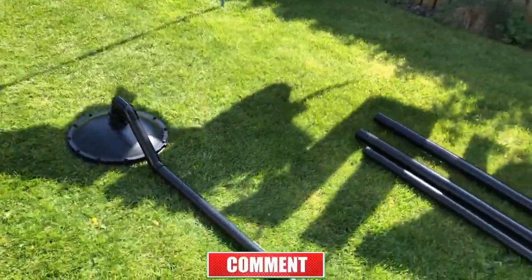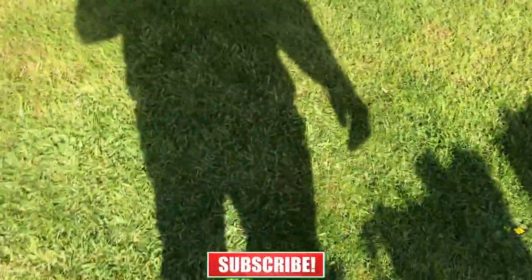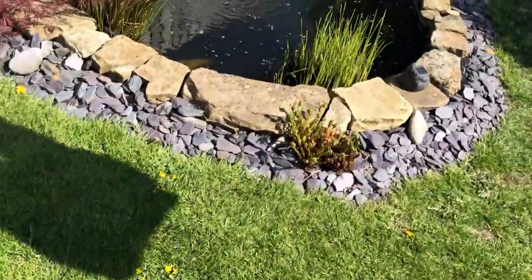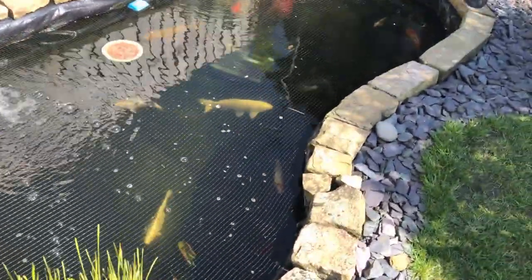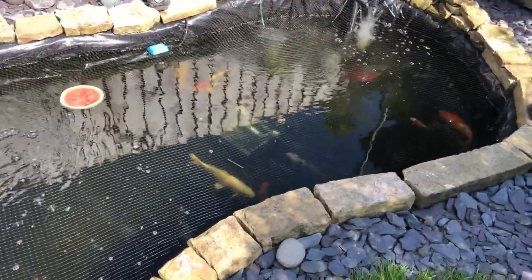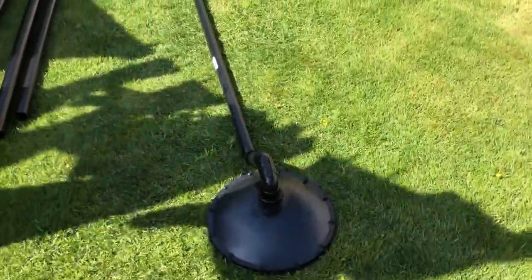All we need to do now is get a pump. I might actually try just trim this off and just run my other pump temporarily that's in there and connect it straight via a hosetail, and just give it a test run, see how it is, because at the end of the day I can just trim that piece of pipe back off again.